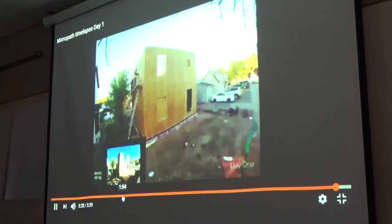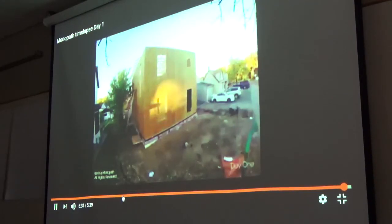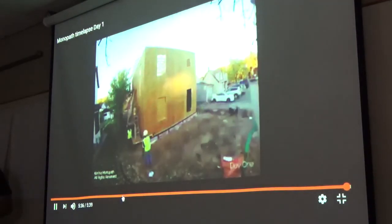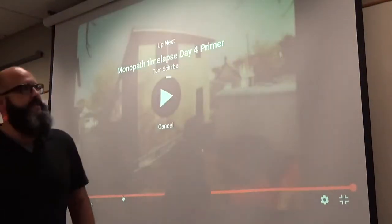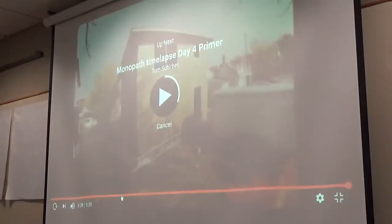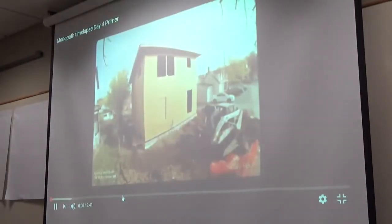That requires you to notch the truss and put a corner block in for its bearing. So as you guys see on that drawing over there, the trusses have a bearing point on this panel. They're going to sit 1 1/8 inches onto here, and then we've got a bunch of fasteners coming through the outside into the heel of that truss.